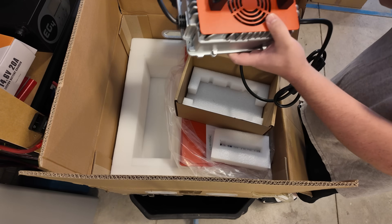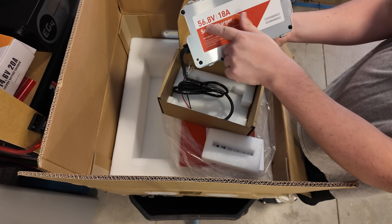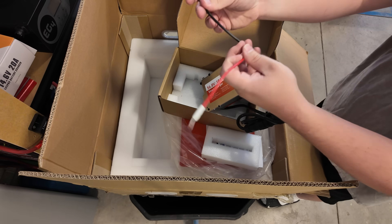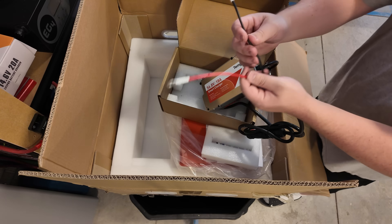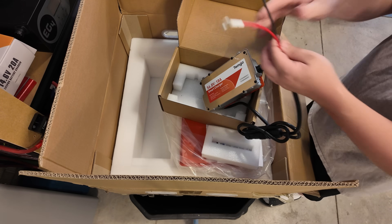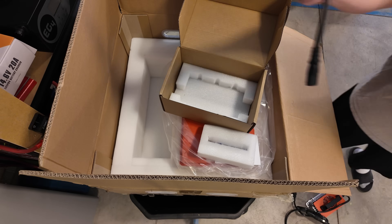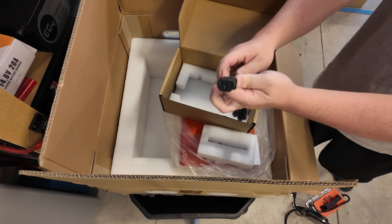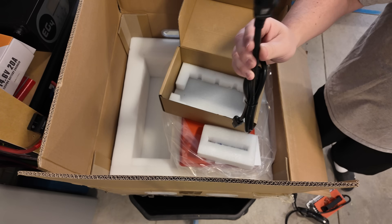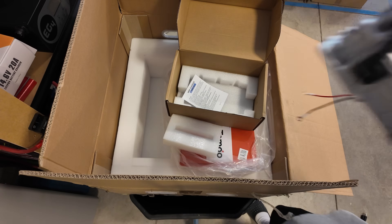Check this out — a really nice heavy-duty charger: 56.8 volt, 18 amp. The cables feel like maybe 12 gauge, which doesn't need to be crazy heavy since we're only pushing 18 amps through it. It comes with a nice charging cable with a standard end, so if you lose it you can easily replace it. It also has a little charging indicator. We'll be testing this charger a little later on.